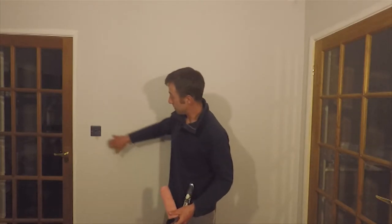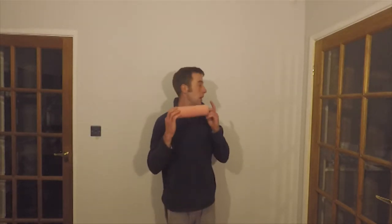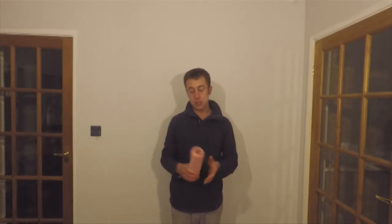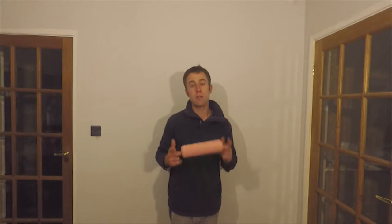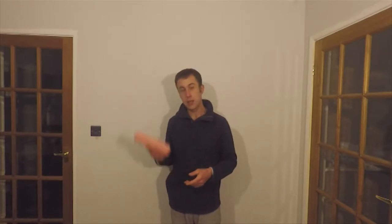Your light switches are going to be dangling out, but basically you get in the places where the roller can't reach. The roller probably could get into the corner, but the edge of it tends to scuff the wall. So that's why we use a brush first. When you do come to use the roller, get as close to the corner as possible. The reason is that it's the roller that gives the texture of the wall — it ends up being slightly stippled. So, paintbrush first around fixtures and fittings and in corners — windowsills, skirting, architrave, coving — then go over it with the roller.